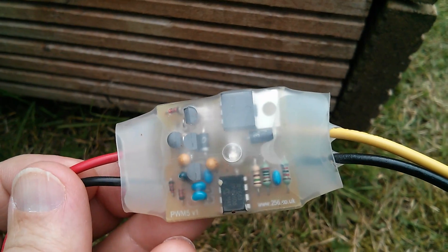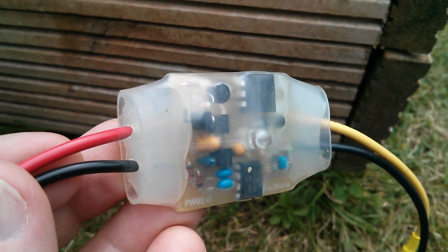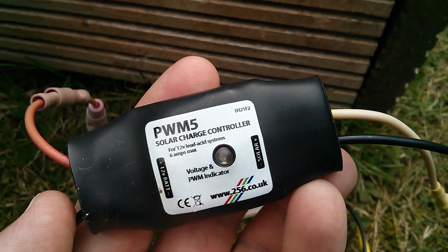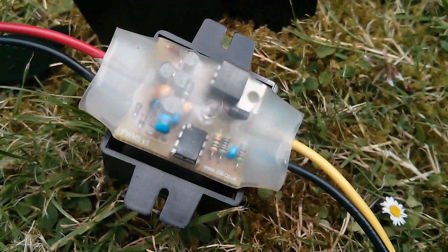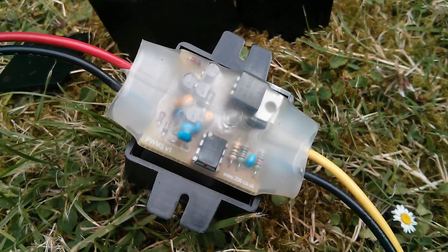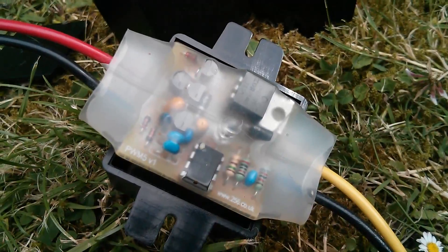With the SunGuard, the PCB is probably just dropped into the box and the potting compound is poured in. With mine I had to put on the inner piece of sleeving — the clear piece of sleeving — pour hot glue into both ends of the unit, which caused all manner of problems in its own right, then fit the outer sleeving with a punched hole for the LED to shine through, and then attach the label. So maybe in hindsight this was the wrong decision; maybe I should have gone with the potting box form factor. I did agonise over this for quite a while, and you can see that the printed circuit board was designed in such a size and shape that it would fit into either packaging type.